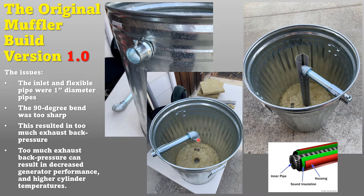The main problem is the one-inch pipe itself. When you get a lot of length on an exhaust pipe with a very narrow diameter, you can get a lot of back pressure into the cylinder of the generator. If you blow air out of a straw it's easy, but if you blow into a long curved garden hose there's a lot of resistance because air has mass. Too much back pressure means the exhaust can't easily leave the cylinder head, which affects efficiency and generates quite a bit of heat.